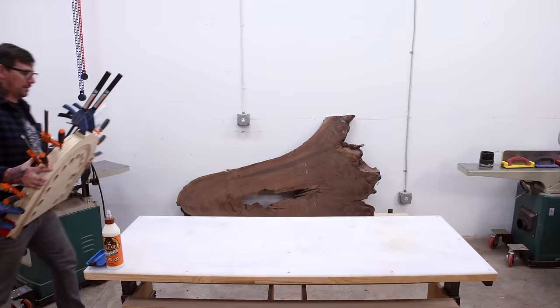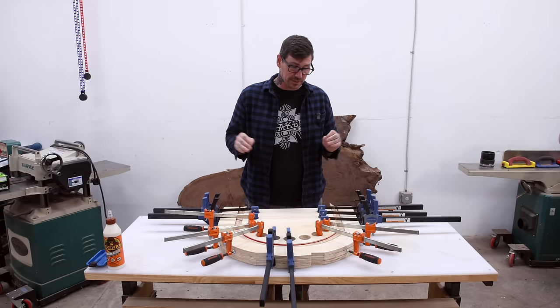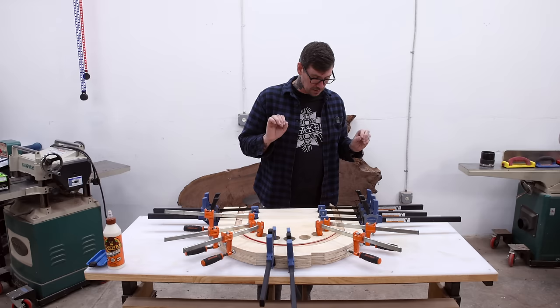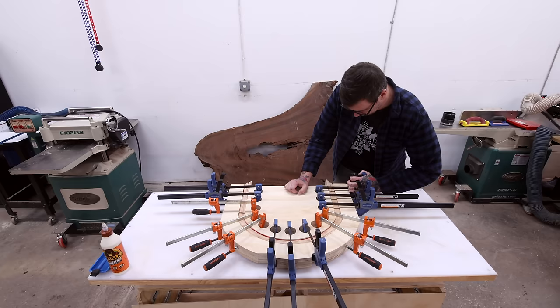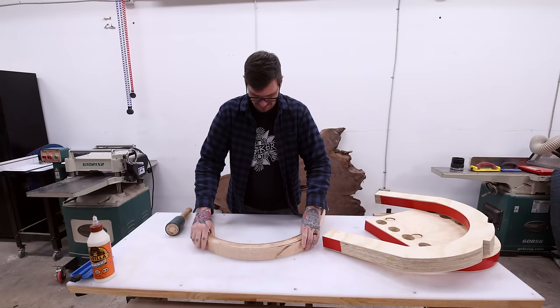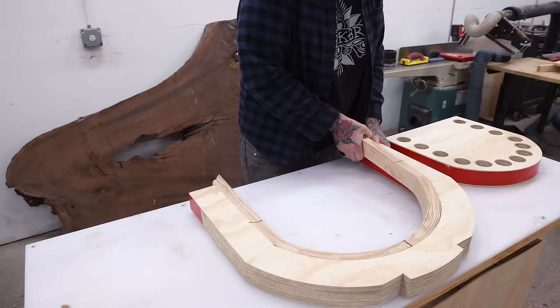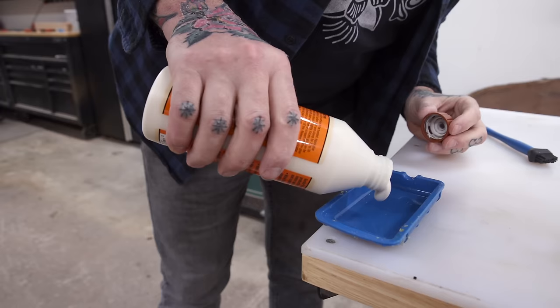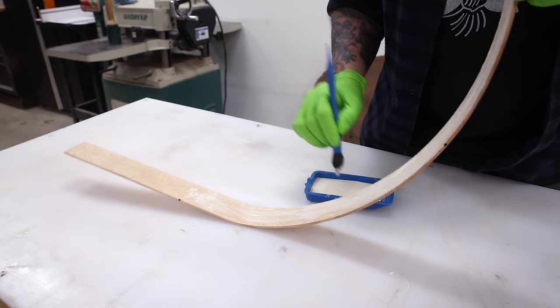Everything I've read says you're supposed to wait 24 hours, but it's only been about 19 or 20. Those bent laminations went really, really well. I know when I take this out of the mold it's going to spring back on me a little bit — that's to be expected. Jinx isn't real, but I hope I'm not jinxing myself. The inner form was sort of tough to get out, but this is looking great — even less spring-back than I was anticipating. I'll put it back in the form to mark my glue line and the new center line. Now the strips have all taken the curve of the form and it's really easy to pop them back into the jig. Leaving the open ends unglued is what will allow me to do the finger joints in the next step.